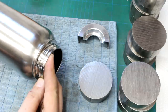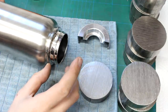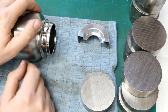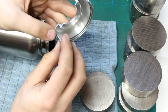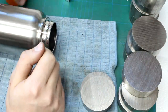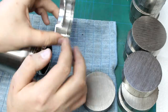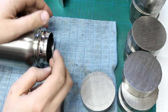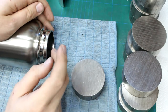What he wants is for me to machine an adapter out of a chunk of stainless that fits over here and has a 70 by 3mm pitch trapezoidal thread. He has some caps machined out of aluminum — I cut one in half so you can see the trapezoidal thread inside. He hasn't made a proper CAD design tolerance drawing, so my task is to make this adapter out of stainless and either weld or braze it onto the bottle.